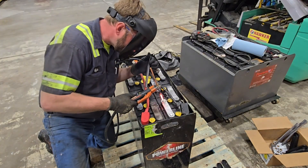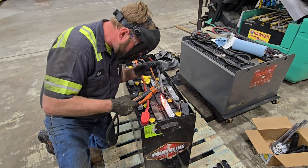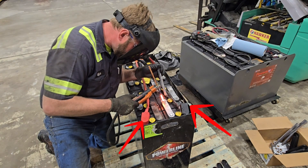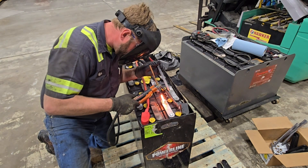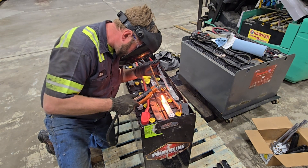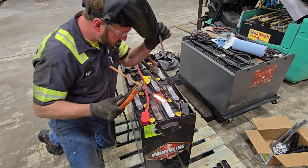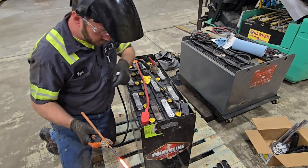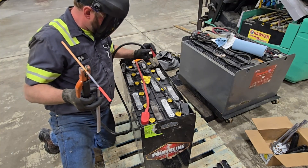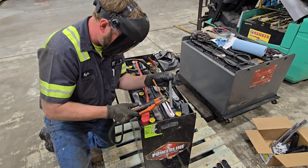You're trying to make it as much of one piece as you can. So you're probably asking yourself how did this happen? The battery cables are basically brand new and you can tell they're recently welded in, so somebody had tried to repair this. My guess is when they tried to charge it and noticed it wouldn't take a charge, they thought something else had happened. I didn't notice until I pulled the intercell connector caps off and saw one had melted through. I went ahead and temporarily welded in an intercell connector and attempted to charge it to make sure there were no other issues.